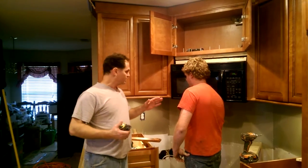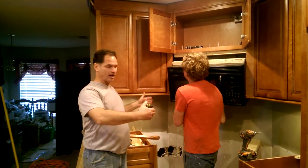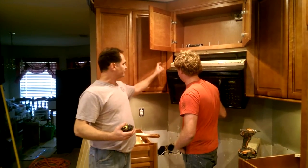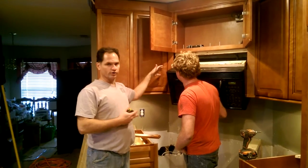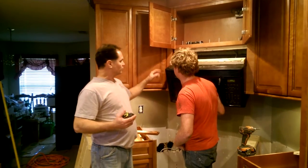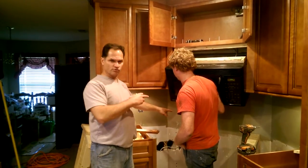What we've done here is we've got a microwave and a stove that's on center on an angle. All the designs say you have to have a five-inch filler on either side of the microwave to make this work, but I figured out a way to do it with three-inch fillers by framing that wall behind it about two inches back.